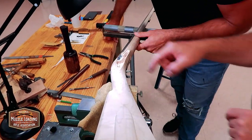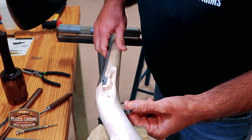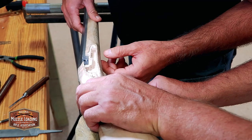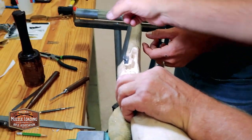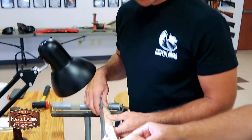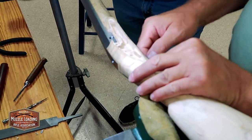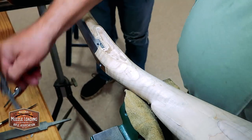What are you looking for? Show me what you're looking for. Look down at that hole down in there. You can barely just see one of the... when you flip it, see it comes up. Your sear — look at your lock plate, that's real close to the bottom of the hole. There still has to be enough room for that when it's all the way in there. It really can't be touching the sear bar. We'll probably eventually have to take more off of the top of the trigger bar, but for now we're going to inlet the rest of the guts in here.